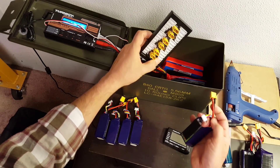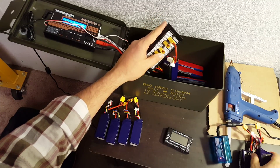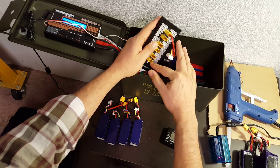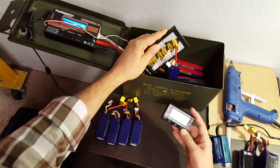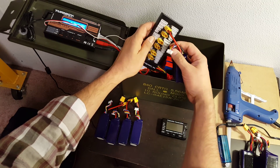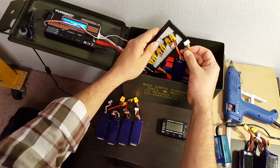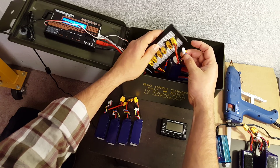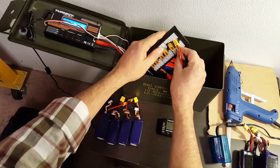This is my charge pile — I've verified that these batteries are safe and ready to go. I plug the discharge lead in first. Some people say you should always plug all the discharge leads in first because there will be a little bit of current flow while the batteries equalize their voltage with each other. If I've verified they're within 0.4 volts, it's probably not necessary, but it's okay to let the batteries equalize through the balance leads as well. The balance leads can't take as much current because they're thinner wires.